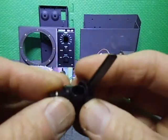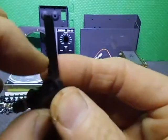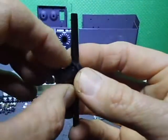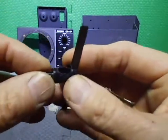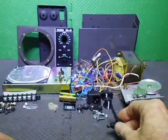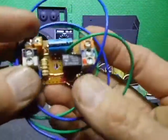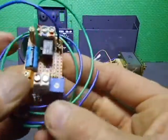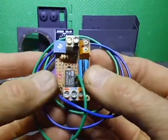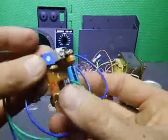I normally replace the globe with an LED. I've got a new system now where I'm eliminating the needle bulb and also putting limit indicator lights in there as well. It uses a tri-color LED — blue for the end of the needle and red for the limit — controlled by a new prototype board, which is a switching network based on my Y-LED configuration, adapted for Y-LED and limit.